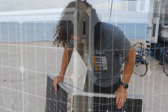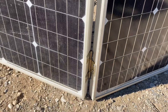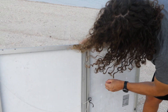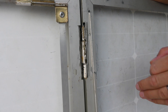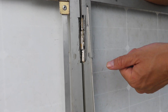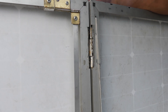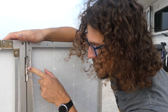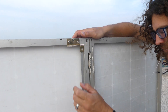Here's what I did to make this work. I just installed a couple of hinges on here using rivets. Let me show you the back side. I really had to grind out a lot of this to make these hinges squeeze in here. There's a little bit of mistakes there as well, but all I had to do was take a little dremel and cut out some pieces here with some goggles on so that I didn't get any of it in my eye. The aluminum is very malleable, very easy to work with. I put a hinge up top, hinge on the bottom, and then another hinge here for the middle leg.